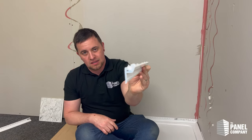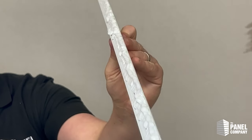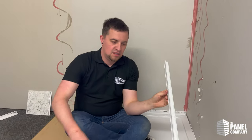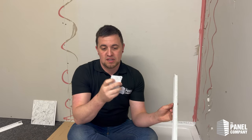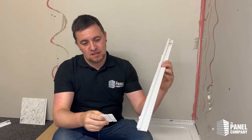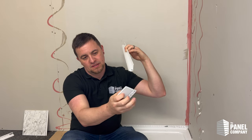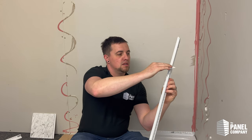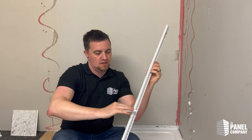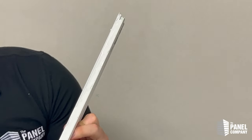You can see that channel underneath is overflowing with silicone — probably a little bit too much in there. You might be worried about making a mess, but that is where the strip end caps come in handy. The only bit of this entire thing that you use are the small punch-out bits that fit the end profile of the clad seal. The rest is for packaging because they are so small you don't want them to go missing, but you can also use the packaging as a scraper to get rid of any excess, so it's nice and even and flat so you don't get any squeeze out.